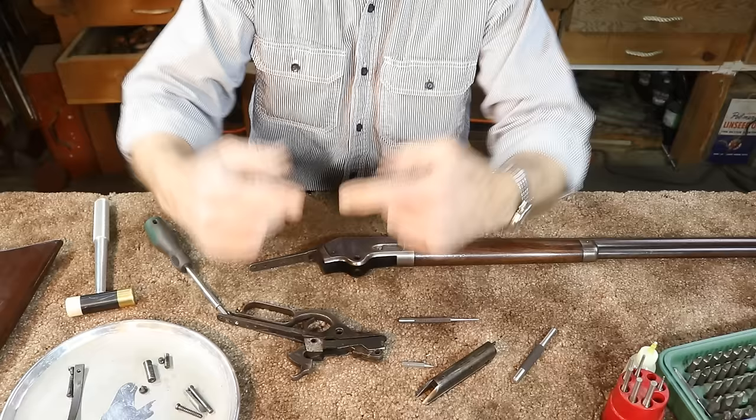Unfortunately, they don't make these parts from Uberti anymore. Here's a bushing that I made, and there's a little groove in the bottom of that bushing or ejector — one arm of the spring slides right into that little bushing, and that spring loads up the bushing and acts as the ejector. Our Winchesters, of course, have a coil spring in them, and I think that's probably a better design. Let's see if maybe we can get this spring out of here — I can see the bottom of the spring so I know it's in there. Probably one leg is broken.